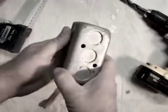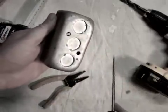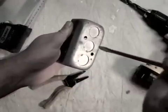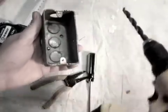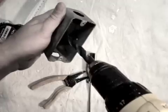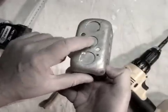I'm going to be knocking out the tab in the center of the back of the box. You'd normally do this by taking a screwdriver or some other device and simply punching it out from behind. But I can't do that to the box that's already embedded in the wall, so in order to remove the knockout from the box in the wall, I'll get a decent sized drill bit and simply drill it out. At some point while you're drilling through the knockout, it should come loose and fall out and you'll see your 3/4 inch opening.